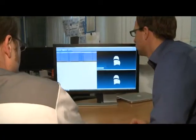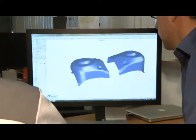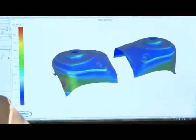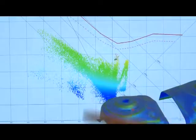This is compared to the ultimate formability limit of the sheet metal, and critical areas on the stamped part are highlighted in colours. The production team evaluates the test report for periodical process monitoring or engineering problem solving.